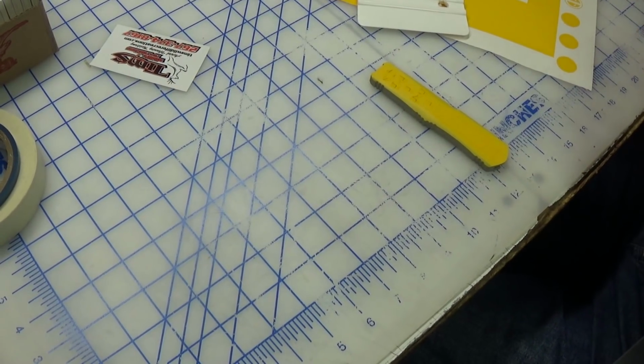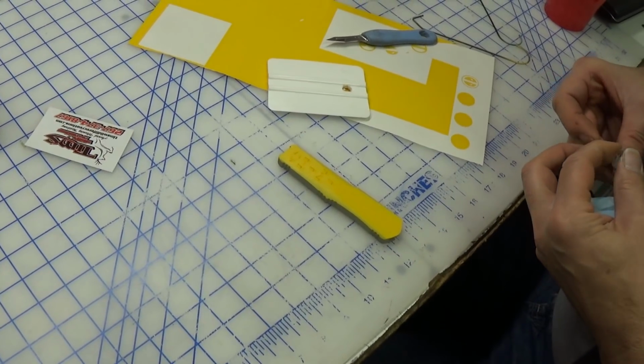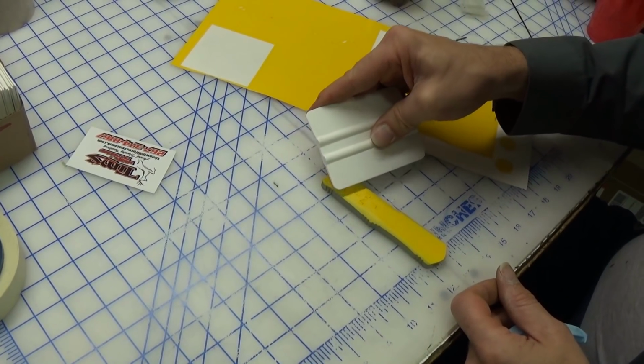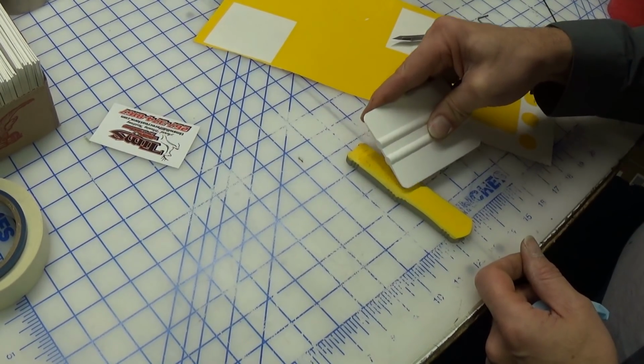And there it is, chimichanga. Now, can we just blast this like regular? Yep. Do you have to take any special care? Nope. I mean, we don't do 100 psi with it. We'll take it down to about 30 because the Cerakote's not cured, it's only flashed. So it'll come off much easier than cured Cerakote will.